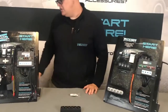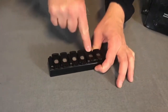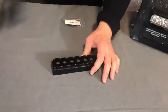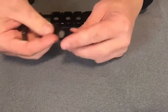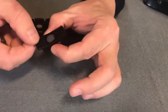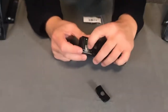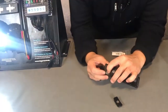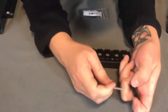Take your standard Trigger remote — these all come with latched switches. Grab a small screwdriver, pop it in the side, and pop the cover out. These switch covers have little posts on each side that you can see — that's what the switch rocks on in its cradle. When we look inside there's a little silicone button. These are actually momentary switches that are locked in place by little tangs on the side.